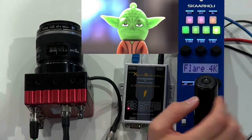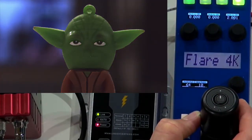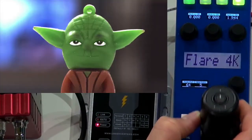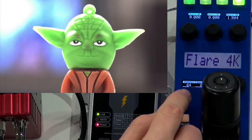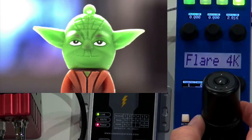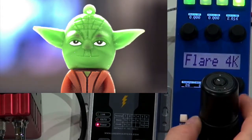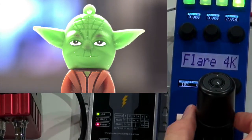The small display will show you the aperture value — that's the value we're sending to the camera, going from zero and then down to, like, 60 or so. You also see the pedestal just next to it in this display. When I turn this ring, you'll see I'm adjusting the black level of the picture. And I can go the other way, so it becomes a little more milky.